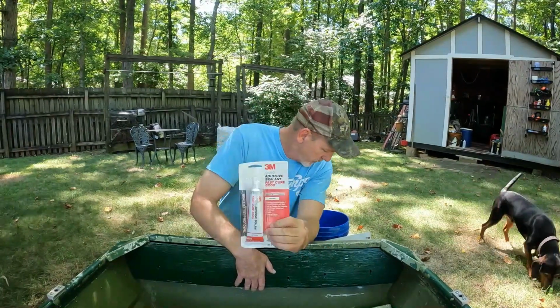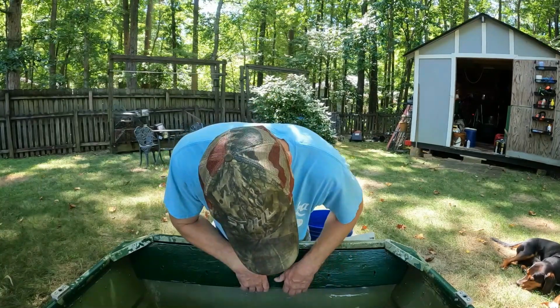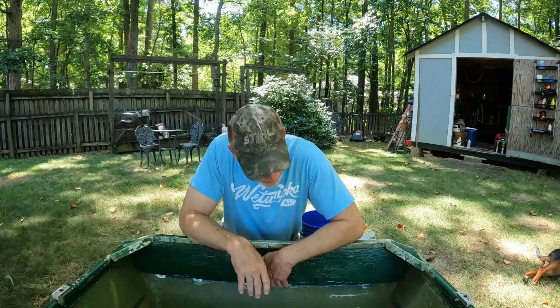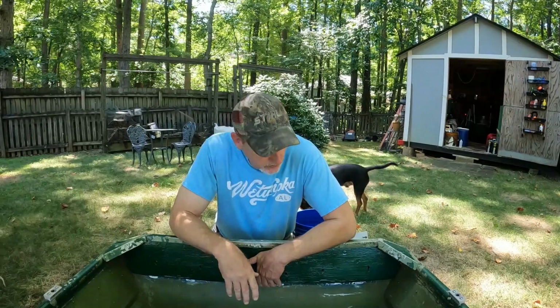The main thing you're gonna need on this today is obviously your power screwdriver and the hardware, but the main thing is this 3M 5200 to seal all these holes, especially these holes down here at the bottom. I've got 1, 2, 3, 4, 5 holes at the bottom. I'll put a link to everything in the description. You can get it at your local hardware store too, but it helps the channel if you get it in the description. But anyway, guys, let's get this thing going so I can take it out next week. You do have to let the 5200, I think, dry for about a week, so that's fine. Today's Sunday. I'm gonna put it in today, and the earliest I'm gonna use this thing is next Saturday or Sunday, so we'll be good.